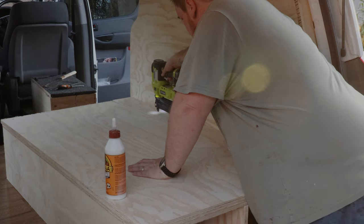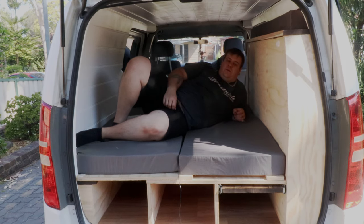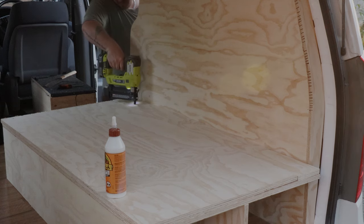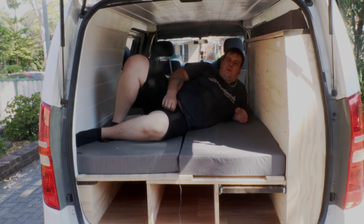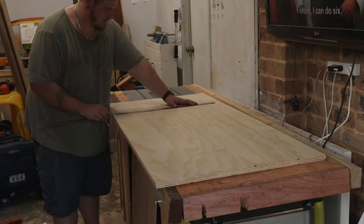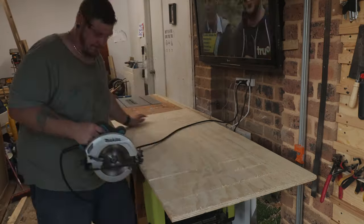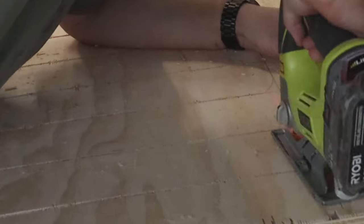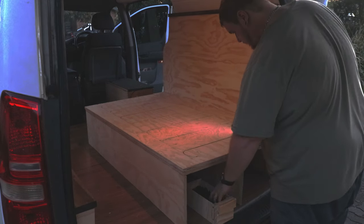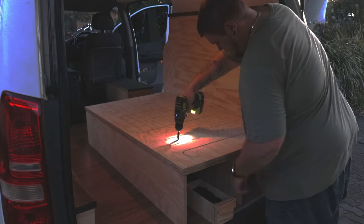When I cut the top, I cut a duplicate for the slats. I cut a 100mm piece off the slat piece and nailed it in place against the backrest to cover the pocket holes screwing the bed top into the backrest. I then marked out the slats — they are 100mm wide — and using a container, I marked a curve on the end of each slat. I used a circular saw to cut each line and finished off the curve with a jigsaw. Using the sliding part of the slats as a template, I then glued and screwed in the parts of the slats that don't move.